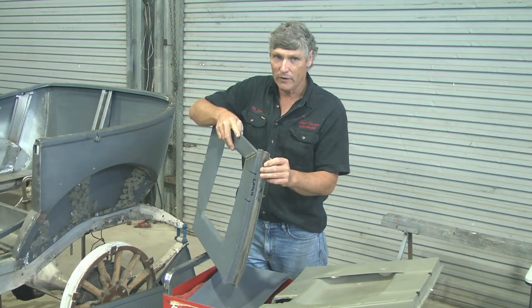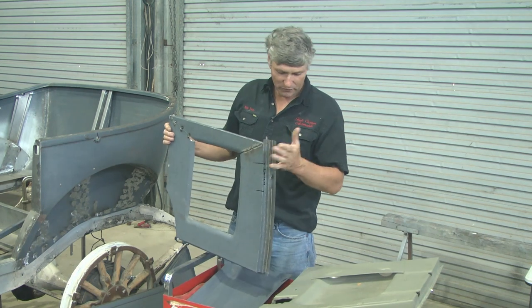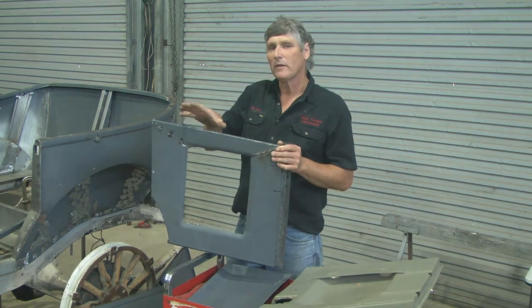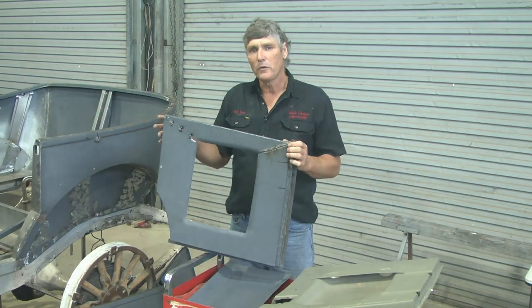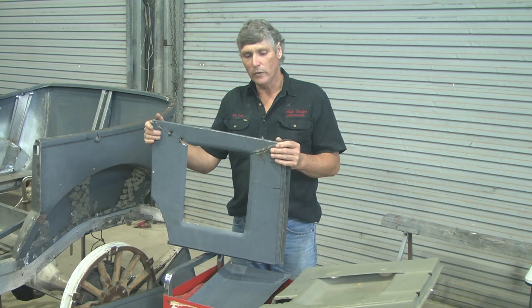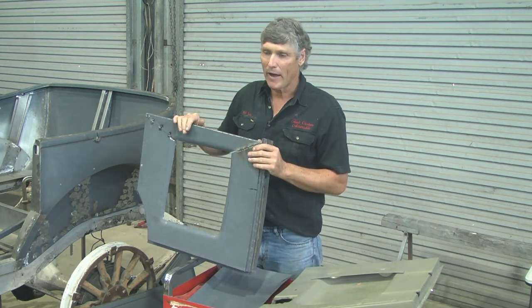I've welded the outside edge on there because the metal's just not going to let you do it any other way — you're going to tear something. For the angles, I measured everything: I put a bar across the top of the door opening, used a gauge to measure the angles off there, got the front edge pretty happy, back edge pretty happy, and then calculated the bottom edge — and the door didn't want to fit in the hole. So I tried it back in the skin and worked out that if I split the top out and just opened it up a little bit, it corrected everything. The split at the back doesn't matter because I'm going to take this section out and put the piece in for the door hinge anyway. The only weld left that wasn't originally planned is this little one across here — I just opened that out and welded the gap. Once the pocket's welded in we can move on to the door hinge location, and in this spot it's going to have the opening made for the door latch, which is just simply duplicating it off the front — they've got the same door latches left and right on the front, and they'll be right and left on the back because the doors face the other way.